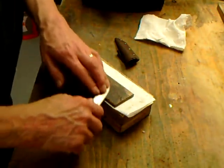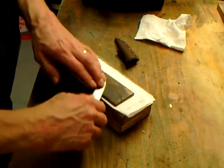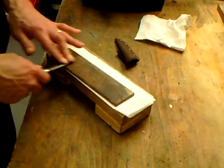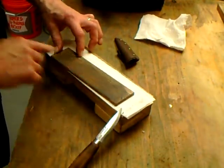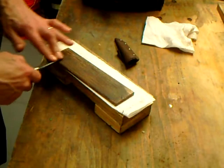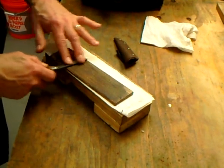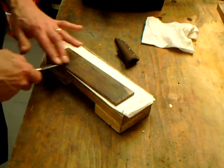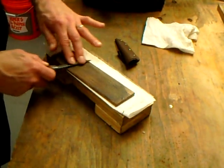That'll tell you how tight you are or how loose. If you're too far back on the shoulder, you'll see where it's not making a nice pattern. It doesn't take a lot of practice to get this right — it's kind of like mixing concrete. You have to have your oil and abrasive mixture pretty good; it doesn't have to be perfect, it just can't be too far off. The burr that does form at this grit level can generally be removed on the same board, either with a back and forth lapping action or even with some edge trailing if you're very light and the burr is very small — much like a water stone.